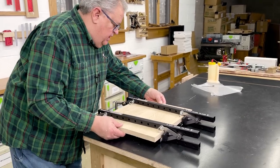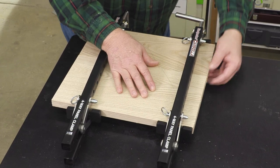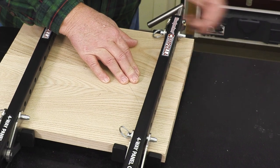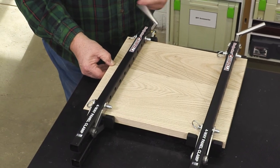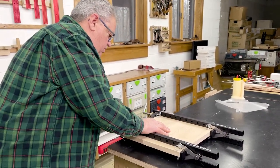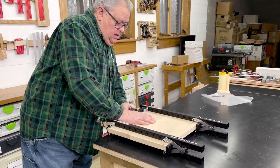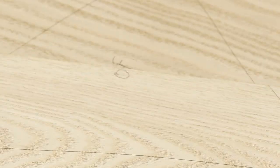Now we just want to bring these down. I'm watching my alignment as I get everything in place, keeping the clamp relatively straight across. My seam feels good, so we'll put a little pressure there. Now we'll do the same thing on this one, and we've got a beautiful seam all the way across. This is a panel that's about the size of a good-sized raised panel door, and you can see that with a good jointed edge, two Clampzillas is plenty for that.